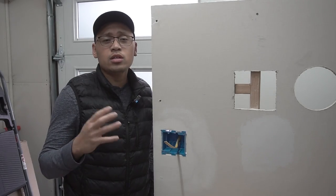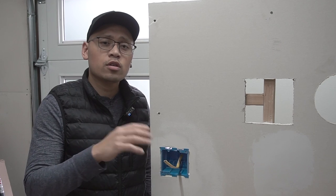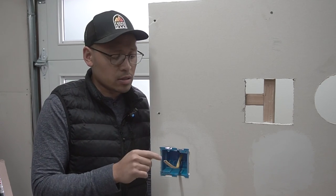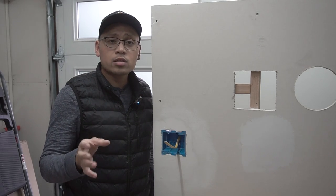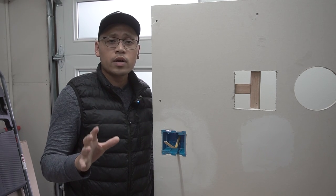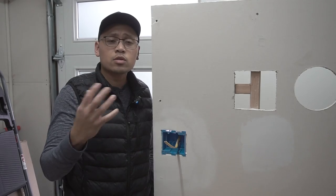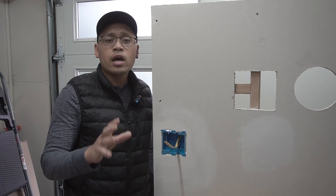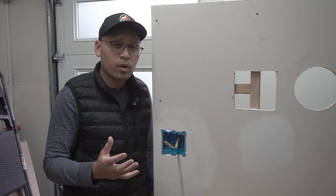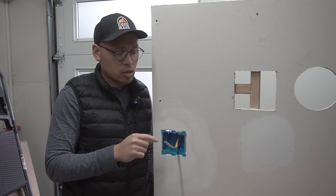You're probably saying this is one of the easiest tasks to do — all you have to do is cut off the sheathing, take it out, you're done, no-brainer. But friends, you have to look at what's inside the sheathing. Inside it are copper wires that are insulated with plastic. It's very fragile if you do it incorrectly, and if you don't pay attention on how you handle your cutting, you can easily damage those wires. In this episode, I want to show you different techniques and how to carefully do it the correct way so that you don't end up cutting any insulation off these wires.